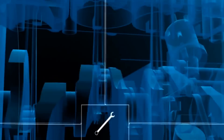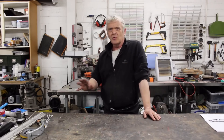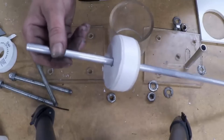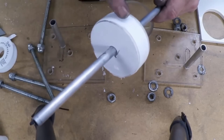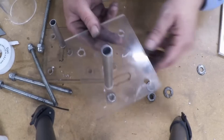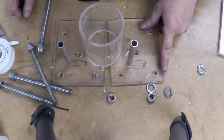We're going to make an air engine that's really easy. An air engine comprises of a piston and piston cylinder, a slide valve and a crankshaft. We're making it because the same ideas apply if you would adapt a normal engine to run on compressed air. The piston itself is on a bit of aluminium rod — nice and lightweight — and is made out of builder's board. In the US you could use Sintra board. I've turned it down and there's quite a thickness of PTFE tape on it to make a snug fit into the acrylic cylinder. The acrylic cylinder is just something I had lying around. The end plates are square and you can see the air inlet. That's about as complicated as the piston and cylinder get.